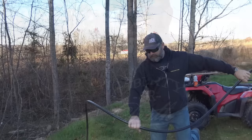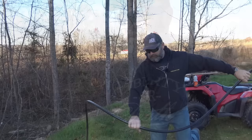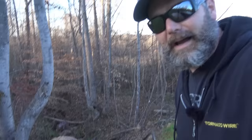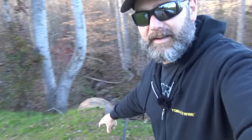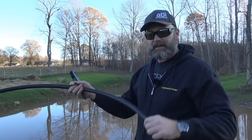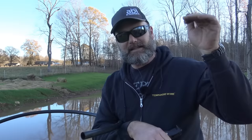The ram pump is down in the woods, right down in that hollow. We're going to run the pipe straight into the culvert pipe that runs into the pond — the pipe goes through there and out there. We want our float system to keep the intake at about 16 inches depth: not on top picking up surface debris, and not on the bottom sucking up garbage from the bottom.